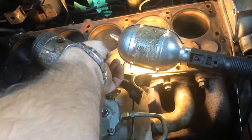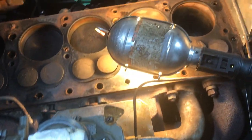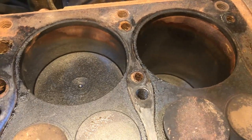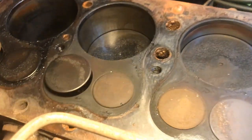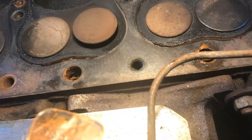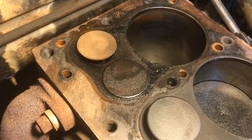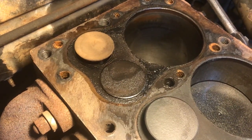Some of my findings: this engine made between 95 and 100 PSI on a cold and wet compression test. The cylinder walls don't appear to be scored up, not that I can see. They sealed for sure, so we know PSI was good. The car started and ran absolutely awesome, as you could see from my multiple videos.